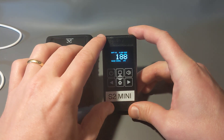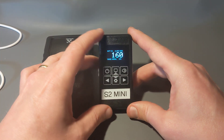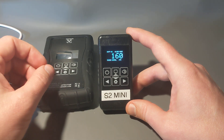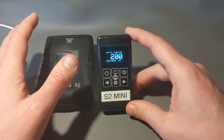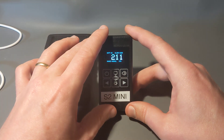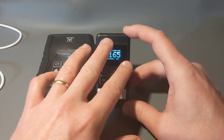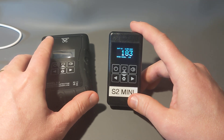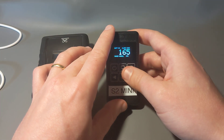Another really important difference from cheap Geiger counters commonly purchased by hobbyists is the much higher maximum range. Both the S2 and S2 Mini go up to about 100 millisieverts per hour as the maximum range using a cesium-137 source. Typical Geiger counters max out at about one millisievert per hour. If you're buying something for an emergency or extreme environment, that's a very big and important difference.